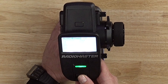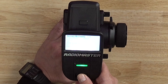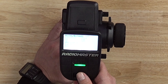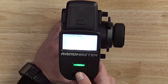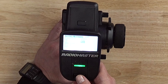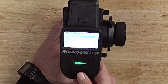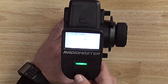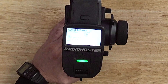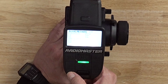Scroll down to T4 and we want it to be plus. For V2, we're going to do T4 minus — so the opposite direction. We also want to make sure that that inverts the signal, so we long press and go down to invert. So as you can see: when T4 hits plus it'll turn it on, and then it'll turn it off when T4 hits minus.